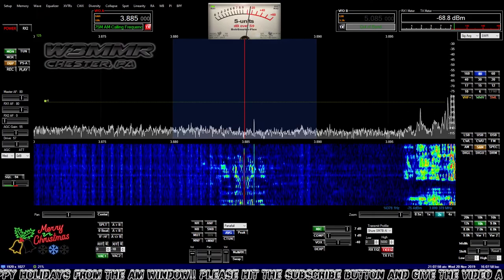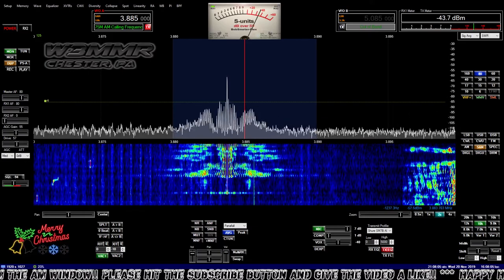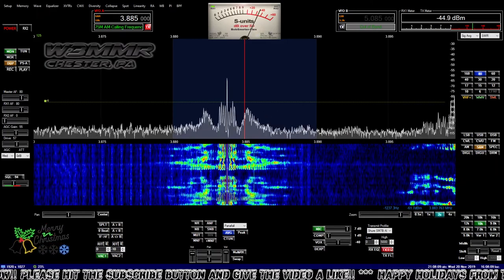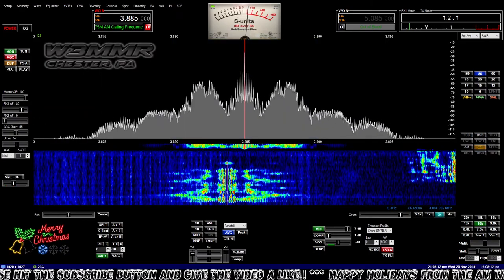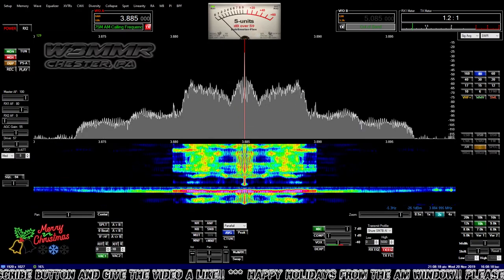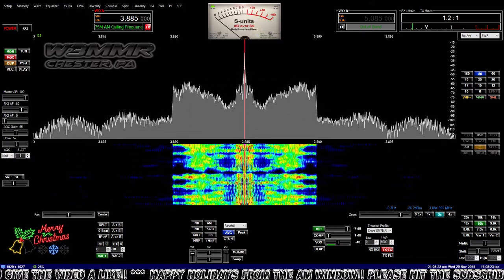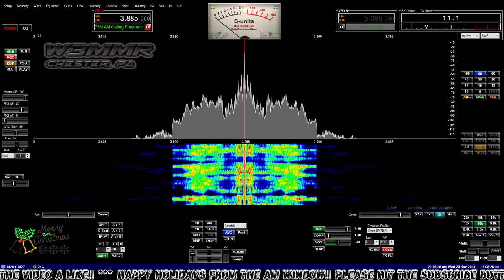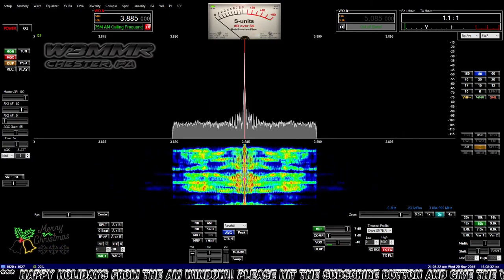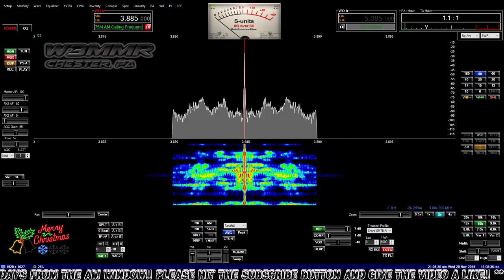I heard some musings from the peanut gallery out of southern Connecticut. I'm definitely seeing a difference tonight — 15 to 20 dB again using a big S-meter with the SDR. You don't even need the S-meter — you go from being really almost full quieting to almost barely in there. It's working good. I'm actually looking at receiving antennas for the house for 160, because I'm using this antenna hooked up shorted as a long wire — it's basically a 160 vertical where the capacitance hat is at. I get a bunch of ground radials outside and it works, but as far as receiving it's very noisy.